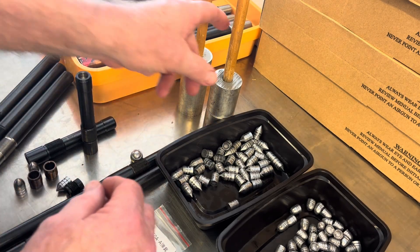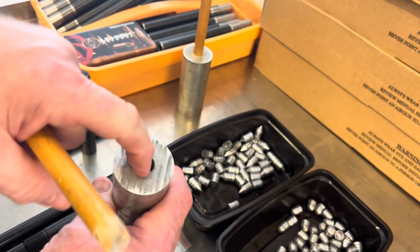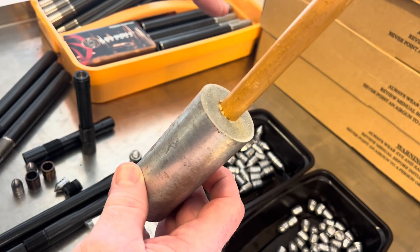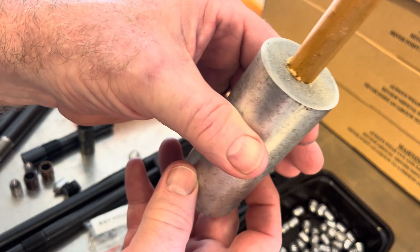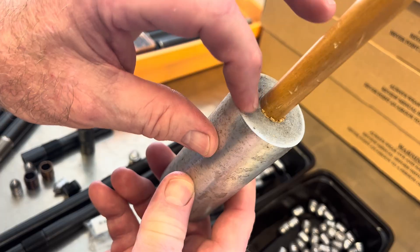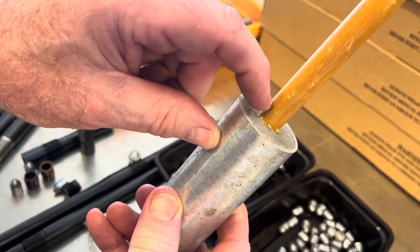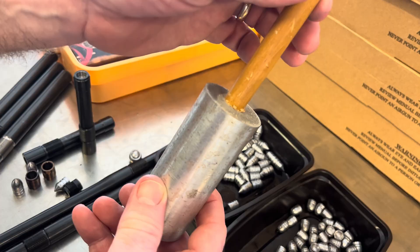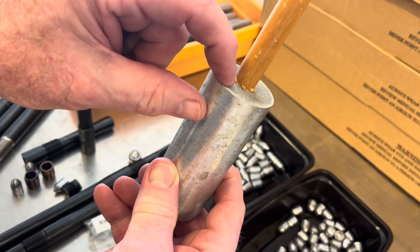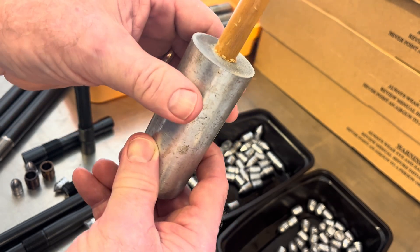To give you some idea of what happens, I've taken two pieces of aluminum and cut the exact same size hole — 14 millimeter. This one I took a hammer and beat down into it because it would not fit in a 14 millimeter hole; tooling leaves jagged marks. Look very, very close and you'll see what happens. This is wood dust — look at the splintering that occurs as this wood was being forced into the hole. This wood is a lot stronger than lead, and the same basic thing is happening if you try to take a lead pellet that's physically larger than a barrel and shove it into a hole that's slightly smaller.